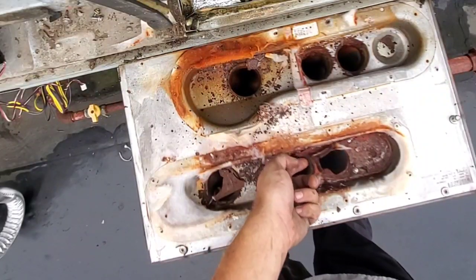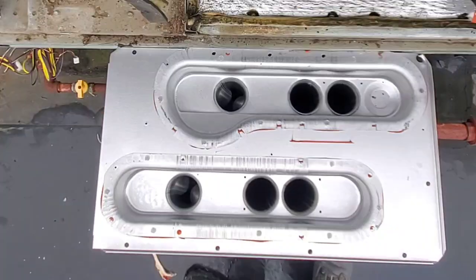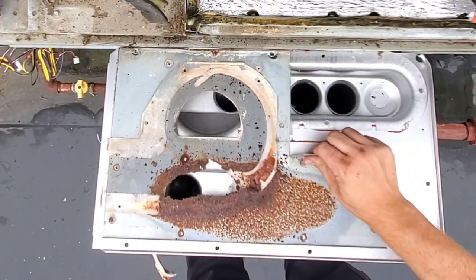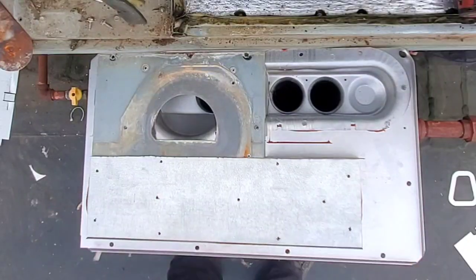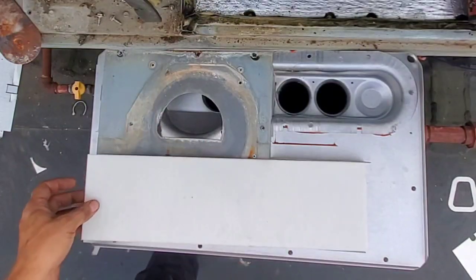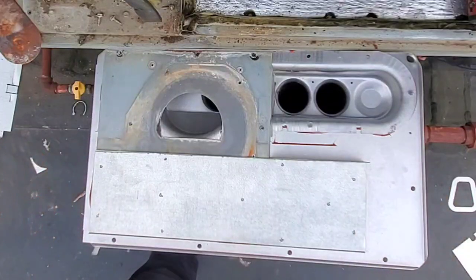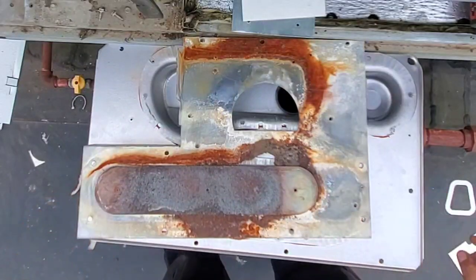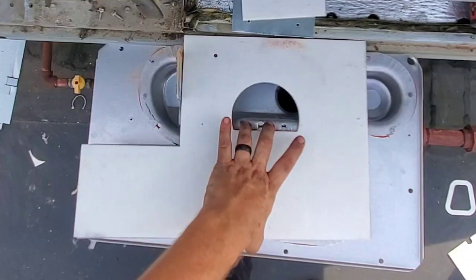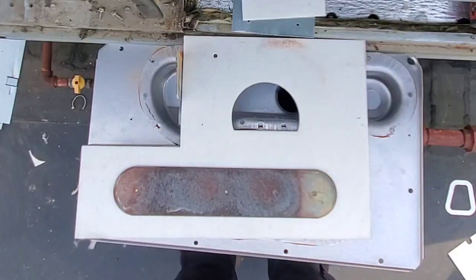That's pretty bad. Here's the new heat exchanger - kind of a goofy design. I'm now cutting out this piece of metal. Good as new. They just happened to send one of these fiberglass gaskets the exact shape and size of the piece of metal that I cut out - I didn't even know that gasket was there when I cut it out. This piece of metal is supposed to go here to protect the gasket from damage from flames. So this little gasket goes here, and this goes here, and it gets screwed from the other side.